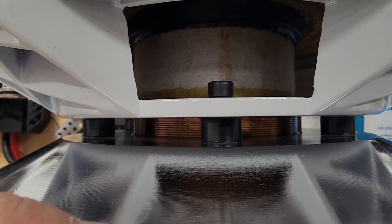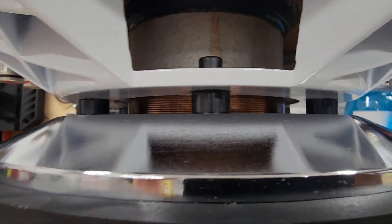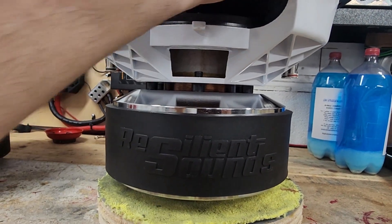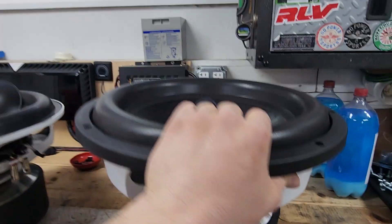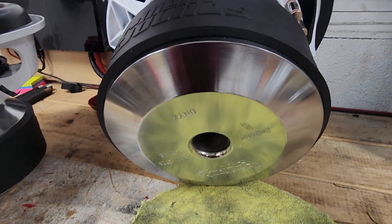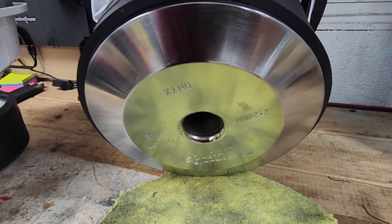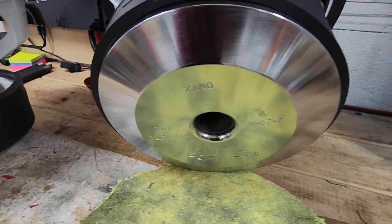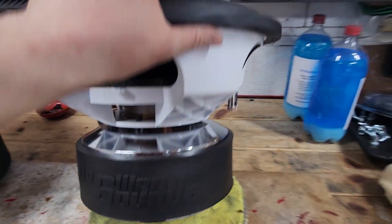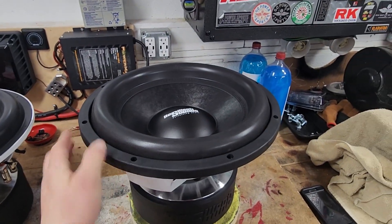Going down even farther you have your four-inch, four-layer flat-wound aluminum voice coil — I'll give you some measurements when I pull that one apart next to me. Nice chrome motor boot ring going down to the bottom here. It's upside down but you can see the nice chrome Resilient Sounds dual-two label — that's this model. They come in dual twos and dual ones. You have your vent, RMS rating, Onyx branding, and that's pretty much it with the Onyx 15.